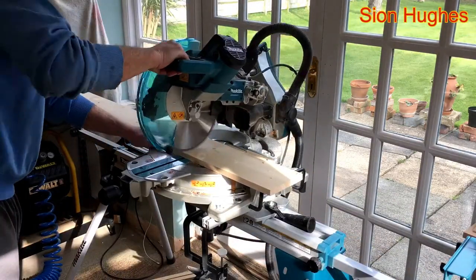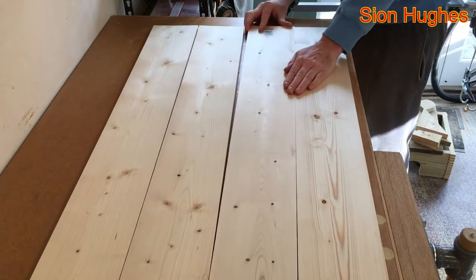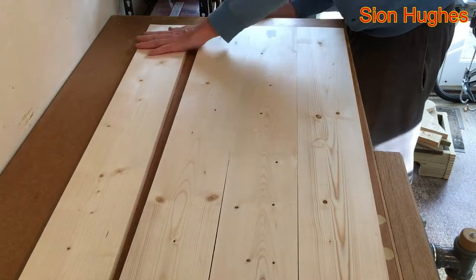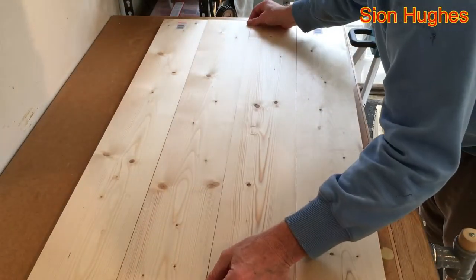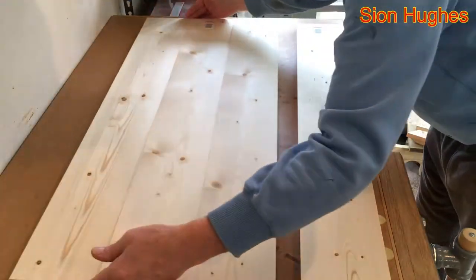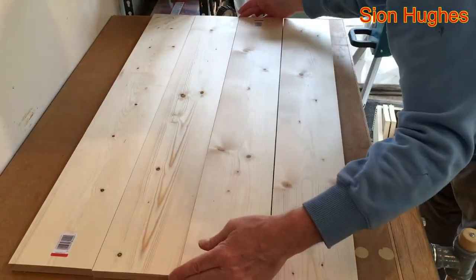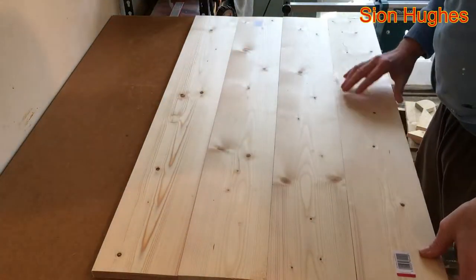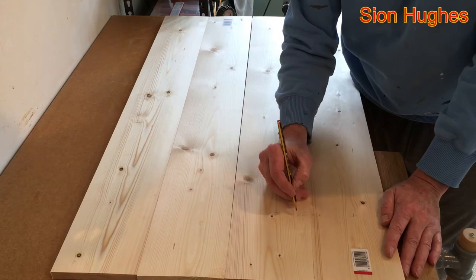I don't know how wide it was, but I cut them up to an approximate length and I have a width in mind. It just has to be narrow enough to accommodate the gap I've got - there's a light switch on one side and the edge of a curtain pole. By jiggling these things around I can find boards that suit being next to one another, which minimizes the possibility of having to do any jointing, which isn't something I want to do.